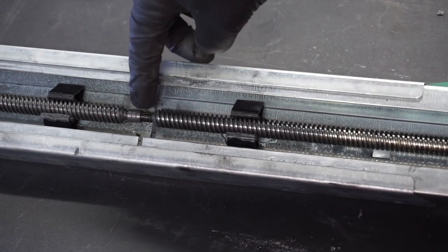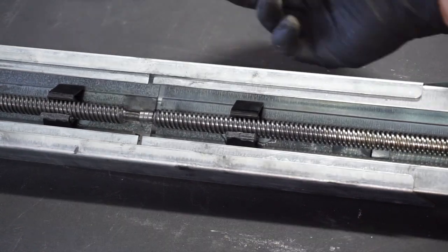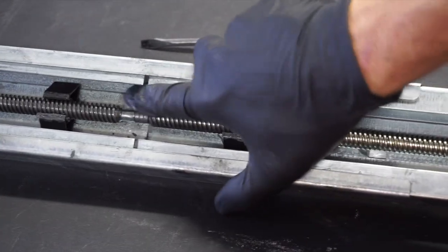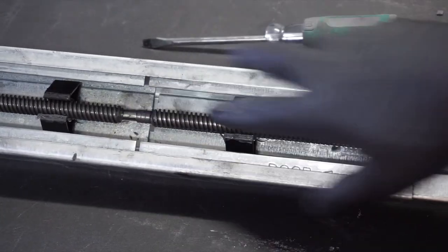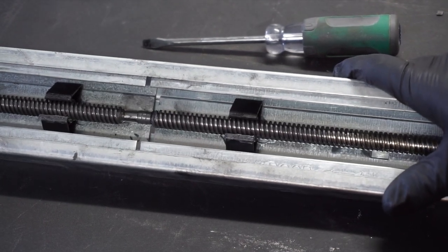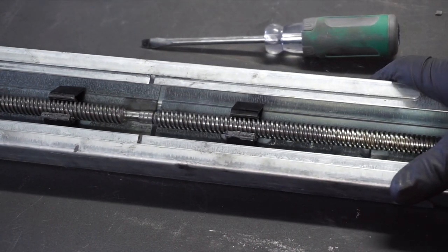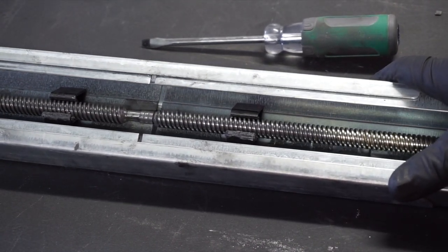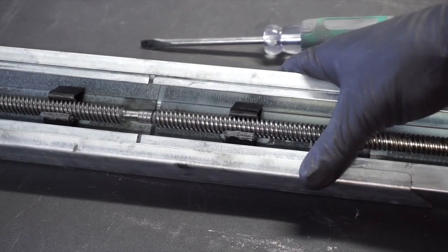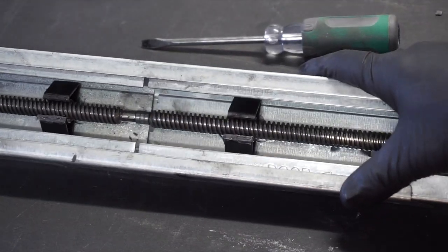From there, you just put your clip right next to it to keep it in place and keep it from sliding out — otherwise the screw will just pop loose when you activate it. Slide that over so it covers the connection and pop that in, just like that, and you are good to go. That's pretty much it as far as replacing that part goes. I will link these parts down in the description if you want to purchase them off Amazon or off Genie.